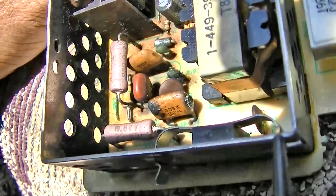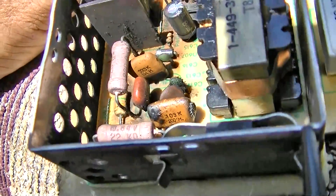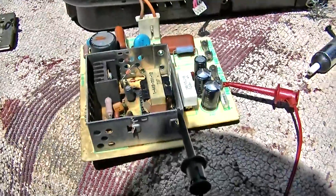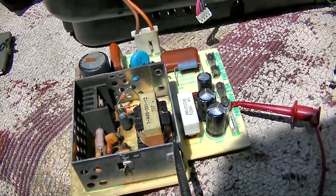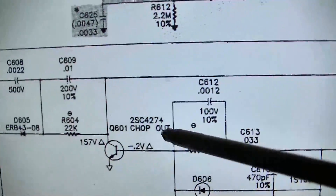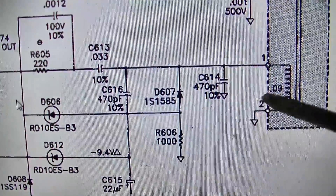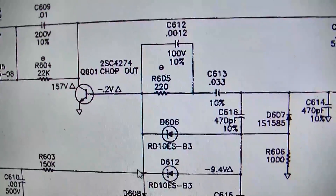See that 103 right there? The side looks blown out. I bet that's bad, causing the thing to just run away and not regulate properly, because this supply is supposed to put out 12 volts. Maybe I missed that capacitor the first time, or maybe it got worse. Those diodes are down here — these are the two Zener diodes in parallel, and they're across the feedback winding. So if that voltage was high, it could definitely cause the whole thing to run away.